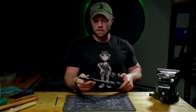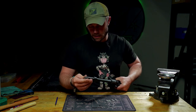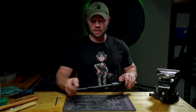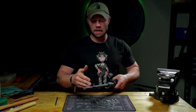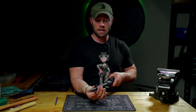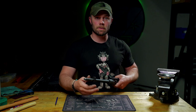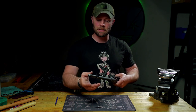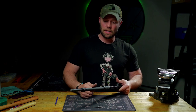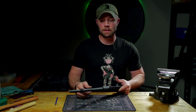We'll go over all that in a how-to video showing how to install these and prep the surface. But with our gas block dimensions, pressing it all the way against the shoulder lines the rear set screw hole up with the barrel's dimple, which places the gas port of the gas block over the gas port of the barrel. Now I just have to worry about left-and-right alignment, and we've got a much tighter fit to the barrel — not bleeding off gas, so we should have more consistent build-to-build tuning and more reliable gas pressures.